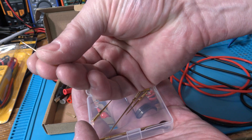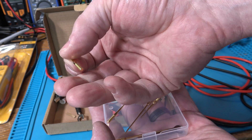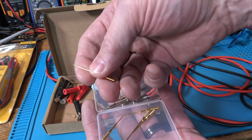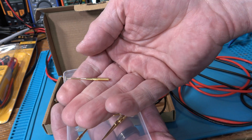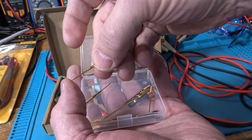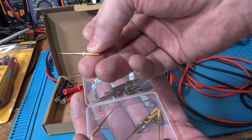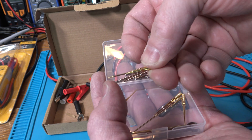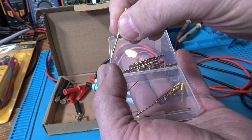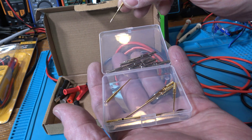These are the ones I like the most — the super sharp gold tips. Sure, if they wear out I spent 19 bucks and I can replace the whole kit for 19 bucks. Those are nice — I use those a lot because they're so sharp they can poke through conformal coating, give you a really good contact to your solder joint, and when you're trying to touch the real tiny legs of surface mount chips you need something that small and sharp to make a good contact without shorting anything.